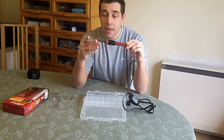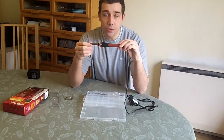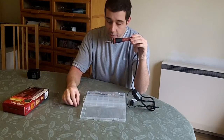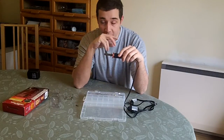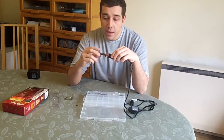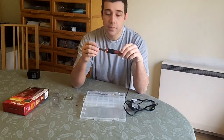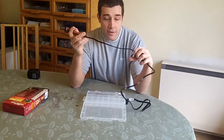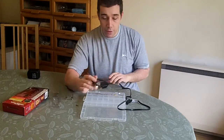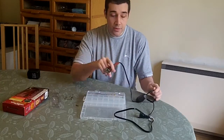If you turn it down while working, don't expect it to instantly change temperature. Also, because it's a screw thread solid point machine, you won't be able to change bits while it's hot unless you're using pliers. Changing bits when it's hot can lead to the bit shearing off — if you put in a bit when it's hot, you should always take the bit out when it's hot to stop it from shearing. Another issue I found personally is that this cable is a bit too short, so when working on a project I'll often be dragging it across my work.